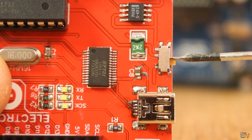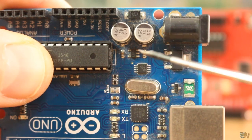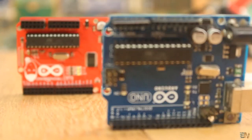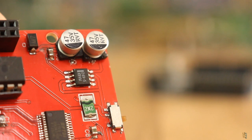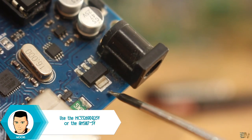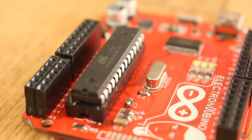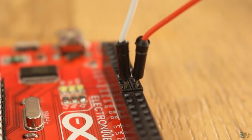I've used a switch to change between external power supply or USB supply. The original Arduino board does this automatically with some comparators and a MOSFET — I've put the original schematic in a link below. For the voltage regulator, you could use the one I used or go with the well-known AMS1117 5V voltage regulator, which is cheaper and basically works the same. I've made my board with two lines of pins since I use those a lot for tests with jump wires.